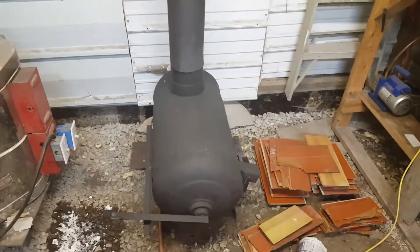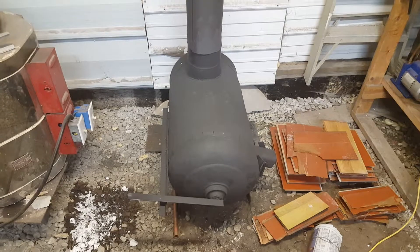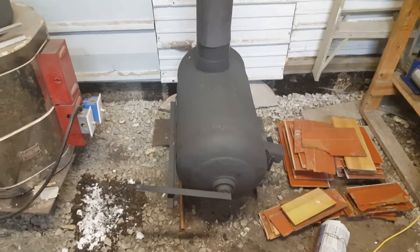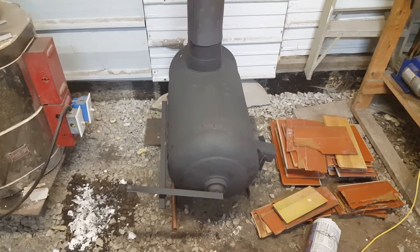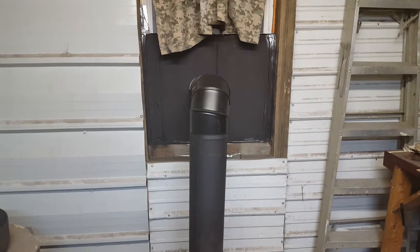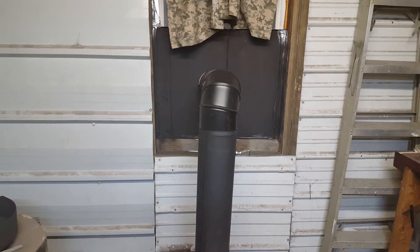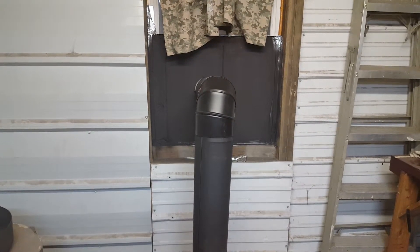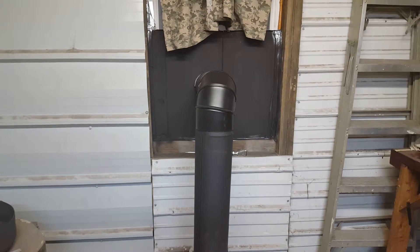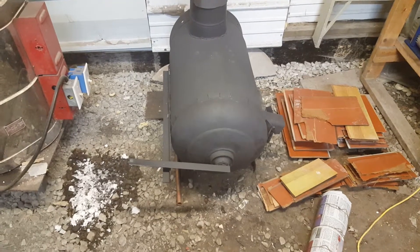Hey, this is Danny Jones. This is part four of my do-it-yourself wood stove made from a propane tank. There were obviously three parts earlier. Right now it's all painted up, it's been installed in the shop here, and it's got a fire going in it. I had the stove pipe up and decided to run mine through the window. I opened up the window, put a piece of sheet metal in there, ran the pipe through that, sealed it all off, and the chimney's outside — so that works out pretty well.